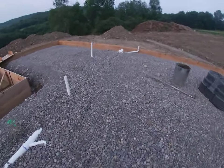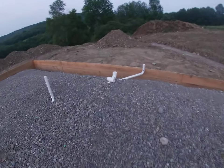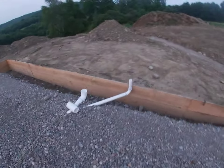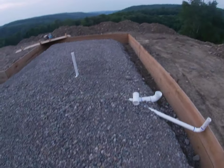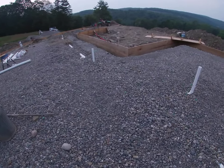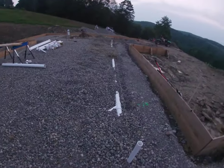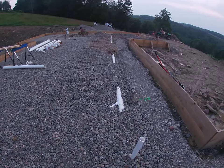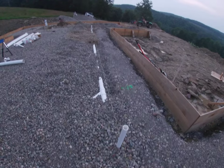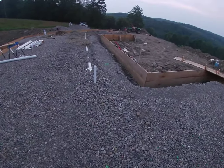Something I would do differently next time is I would not get round stone — I would get crushed stone if you can get it. It was eight bucks a ton for rounds for us in this area; I think I quoted it at a couple of spots and it was like 16 or 17 bucks a ton for the crushed. Crushed stone, after you tamp it, would lock in a little bit better, and once you've hand-dug all of your sanitary lines it would be much easier to keep them clean and consistent. Constantly when I'm digging these, the stones are falling back in and it's kind of a pain.